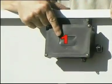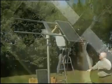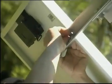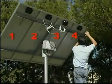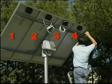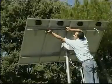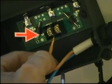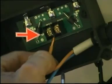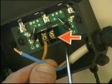The panel marked one must be placed, looking at it from the coupling box, to your left. The first screws are inserted but not tightened, so as to be able to move the panel, if necessary, within the dowel slots. We do the same with panels two, three, and four, taking care to follow the order in which they are numbered. We now tighten the screws with the tools provided, and proceed to the electric connections. The electric cable is inserted in the connection ramp on the first panel, connecting the brown wire to the positive terminal, marked plus. After tightening the screw, we repeat the operation with the blue wire to the negative terminal, marked minus.